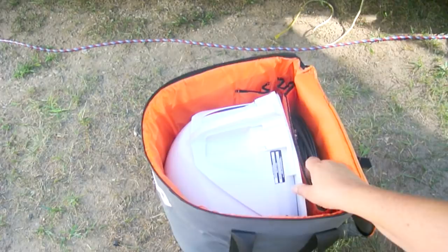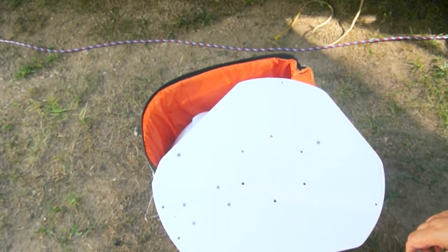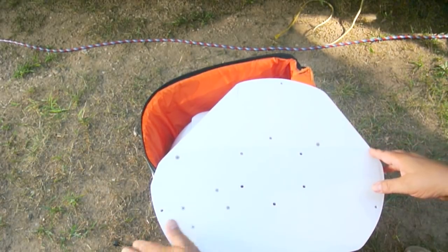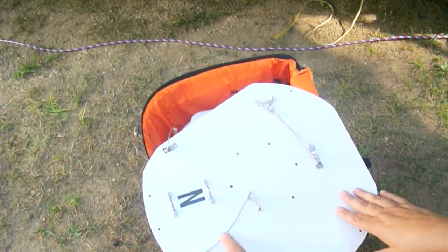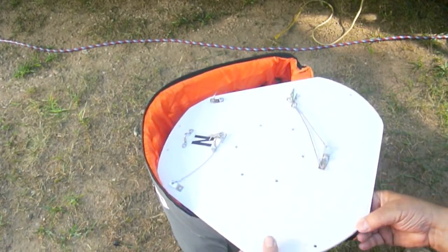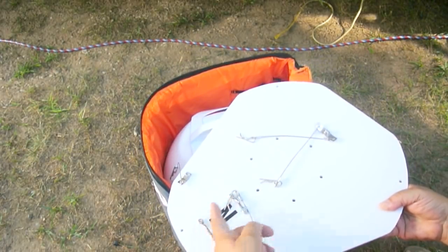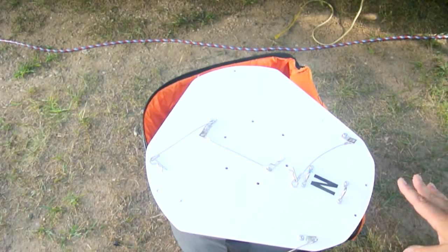In the satellite bag, I also built a base. It has the footprint of the satellite antenna on it — these are the six screw holes that hold the flange on the mast. On the bottom side I put N for north. This is made out of PVC plastic, 1-1/8 inch thick, and it's pretty hefty — I think it will hold the satellite okay. We have these little quick-disconnect cotter pins, and a couple of pad eyes for the cable. There's really no need for a dimension drawing — basically you just set the satellite dish on and trace around it, and that gives you the outline.